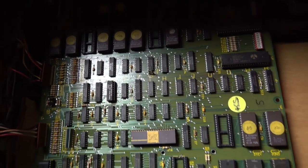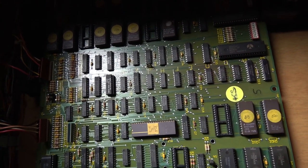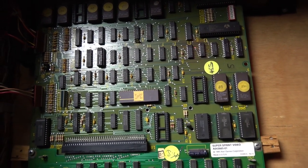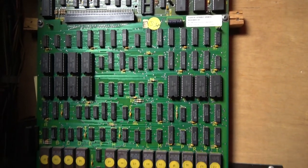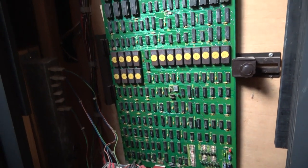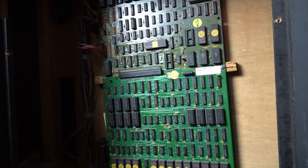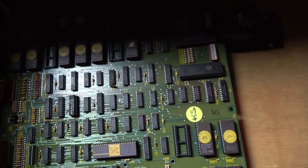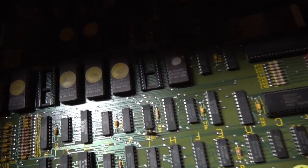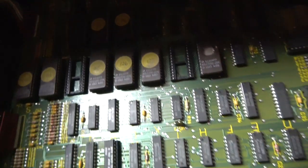The multi-slapstick lets you emulate different games via DIP switch, though you'd still have to change the ROM sets manually until someone makes a proper multi-board — which would be pretty cool. I'm going to remove the top board and swap the whole CPU board over. I'll initially leave the sound ROMs, since I think they're the same, and if it doesn't work I'll swap those top ROMs across. Let's flick over to the Championship Sprint and see what's going on around the back.